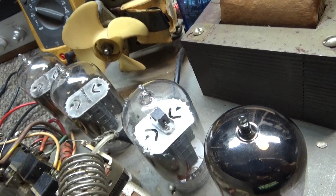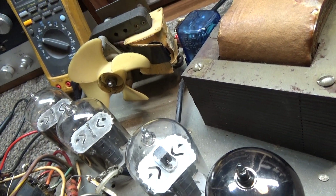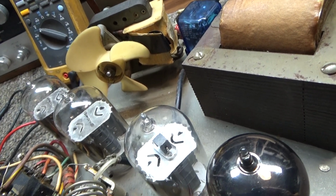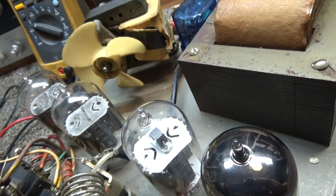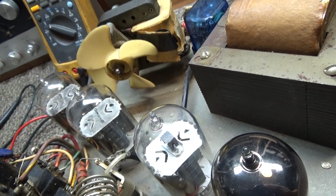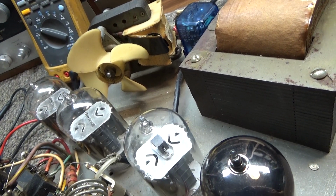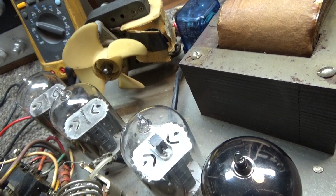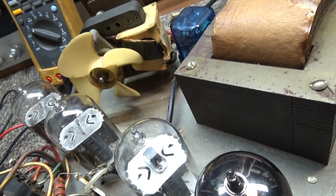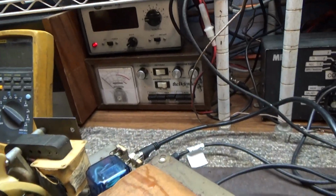And then the 10 tubes, or whatever they are, 8 tube, 10 tube, those need to be matched for the amp to work right, and one tube not being a hog or going into oscillation and all kinds of other problems. So the set of tubes that are in the same circuit, like if you got 2 driving 8, the 2 would need to match, and then the 8 would need to match each other, but the 2 don't need to match the 8 at all, if you know what I mean. So hope you get that.